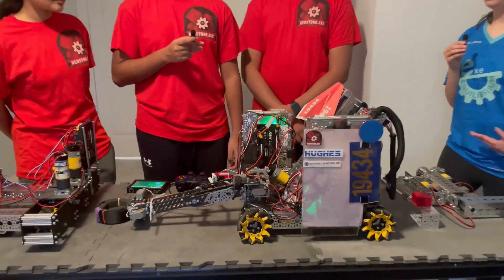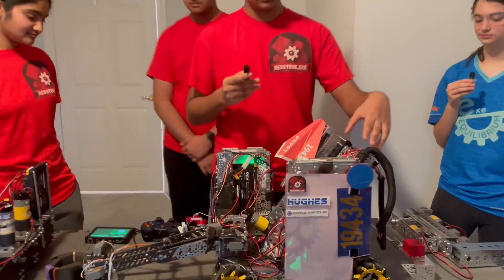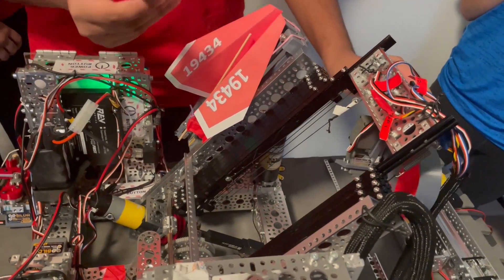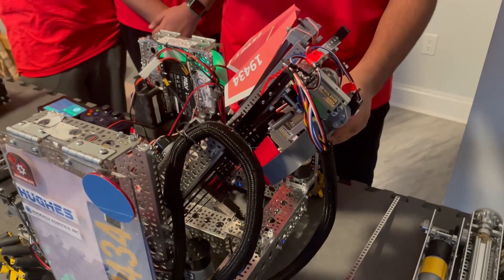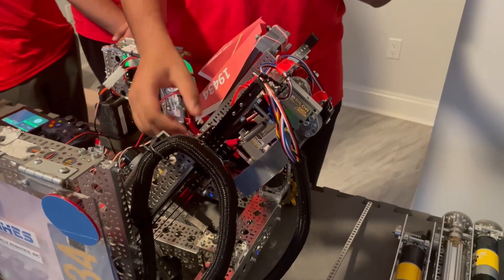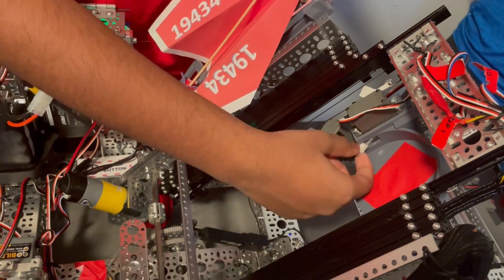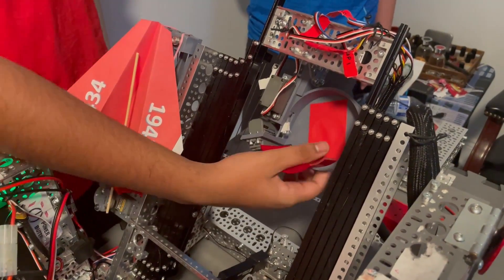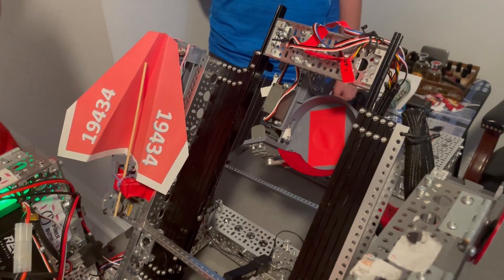So now you have your pixels in your robot — how does it work getting them onto the backdrop? We use two sets of slides to lift our deposit mechanism to the backdrop, which is angled so that the touch sensor on the back gets pressed and changes the angle to be flat against the backdrop. We then use a servo to control our gate mechanism to open and let the pixels fall onto the backdrop. We also have another servo inside which holds a second pixel so that we can drop each of them independently and don't risk missing the backdrop. We recently added a funnel so that pixels more accurately get transferred from the intake to the outtake.